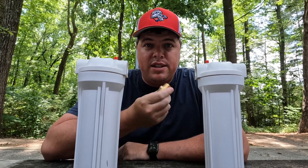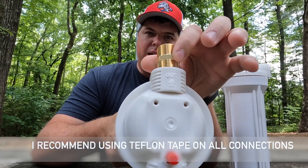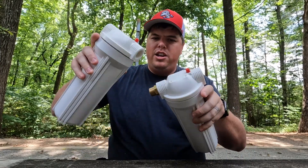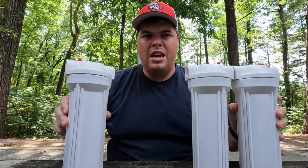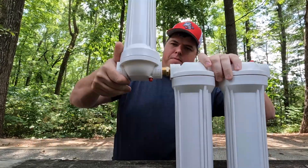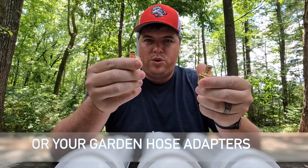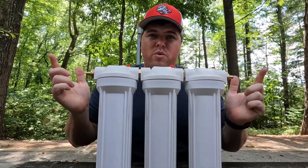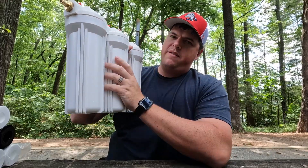Step one: you're going to need two filter housings and your male-to-male pipe fitting. Make sure on your first filter housing you locate where in and out are, and you're going to screw your pipe fitting on the outside. You're then going to take your next filter housing and screw the inside to the outside. Tighten it down nice and tight. Now rinse and repeat with the last filter housing — screw your pipe thread into the out. Then screw in your three-quarter-inch NPT to half-inch PEX on the outsides of the filter. Use a wrench to tighten. Now locate the inside of your filter and install your 20-micron filter, followed by your five-micron, followed by your one-micron.